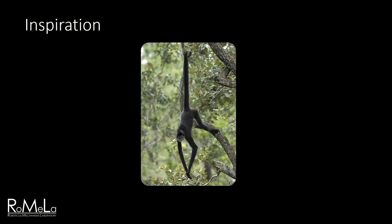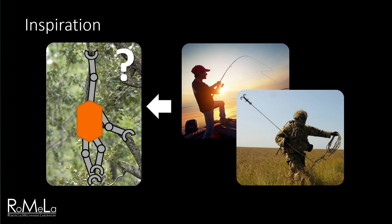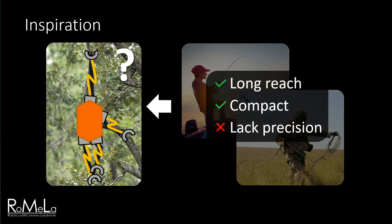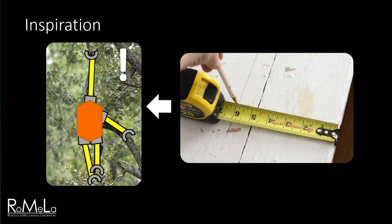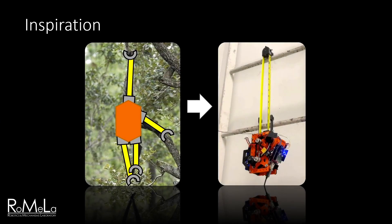So let's imagine a climbing robot that grapples onto points just like the spider monkeys, with its body here and some limbs. For establishing distant anchors, we can look at fishing hooks and grappling hooks for inspiration. These involve launching a hook far away and reeling it in with the spooled material to retrieve fish or ascend buildings. But while these spooled devices grant a very long reach in a compact package, a major downside is the lack of precision, since the hooks are attached to an amorphous string. We can remedy this by incorporating a spooled material that does hold its shape, like the common tape measure. These steel tapes have a curved surface and spring properties that give them directional stiffness. Folding the tape also gives it different mechanical properties where the cross-section is forced to flatten out. Combining these ideas, the flexible EMA limb presented here is our first step towards achieving a versatile system that can climb through difficult environments and manipulate targets from far away.